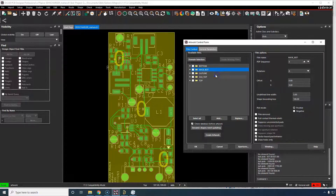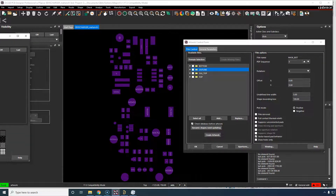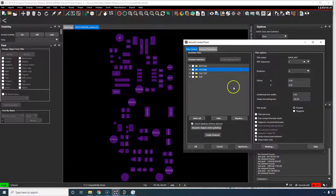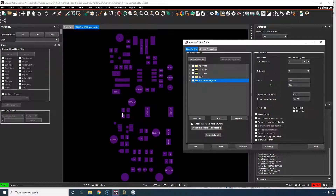I should have added this to the tutorial. Anyway, how do we fix this? Right-click cut. Go to change our colors. With the colors available, turn everything off, then turn solder mask top on. Now with solder mask top on, right-click and add. This is what we have to be looking at first before we add anything — mask top, solder mask top. Display for artwork check, the top copper — if we display for artwork check the solder mask top, that's how it's supposed to look. Finished, for the solder mask.